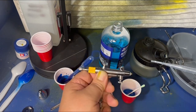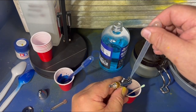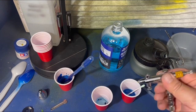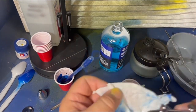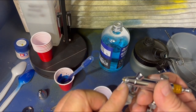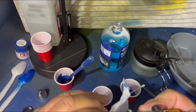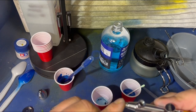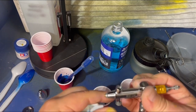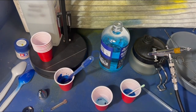What I want to do one more time is take a little bit of solvent and run it clear through there. Shake it out real good. Let's get the rag, find a clean spot, and wipe that out. Be mindful of this O-ring right here — if that O-ring goes bad, you lose that seal and you won't get paint to pull down through the suction; it'll just bubble up back into your cup. So there we go, we're done there.